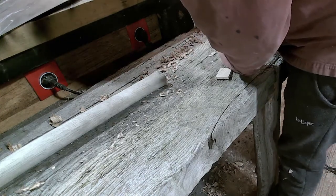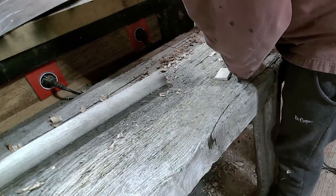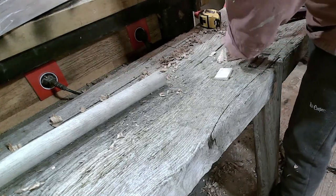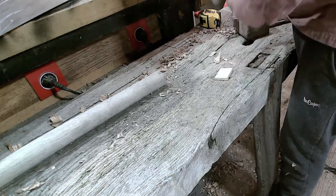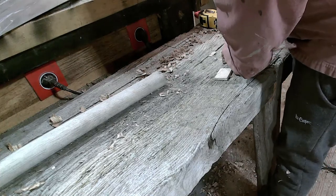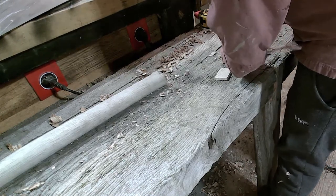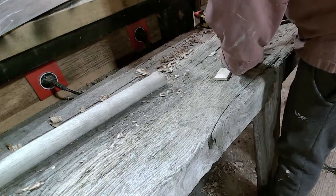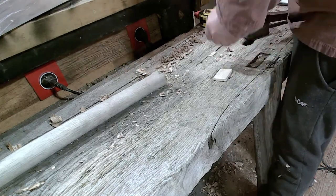Normally I cut them on a bandsaw, but there are 2 reasons why I'm not. One is, one of my bandsaws broke a blooming blade yesterday, so it's a bit annoying. I could put some device into it that way, but it's quite thin. The way of doing wedges is you either cut them straight on the table saw with an insert in, so it's not too wide around the blade. And the other way is you do your angles, you cut them in half, split the difference, and then you can use the fence. That makes life a lot easier.